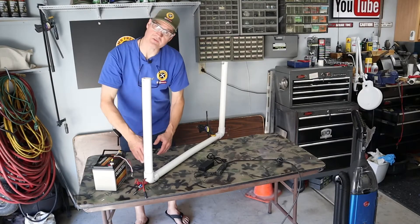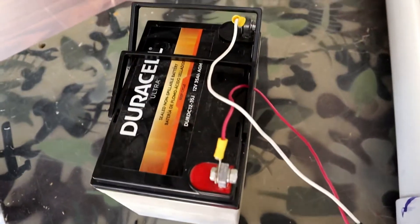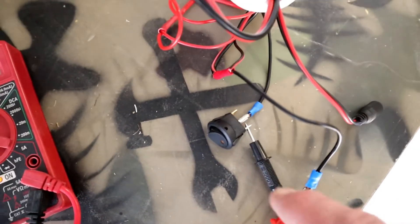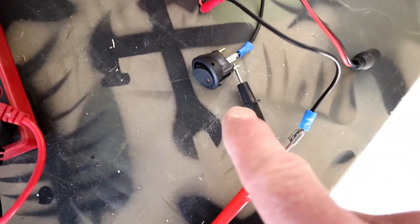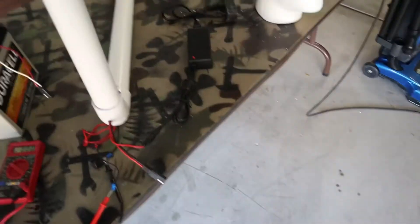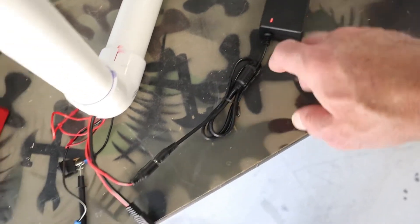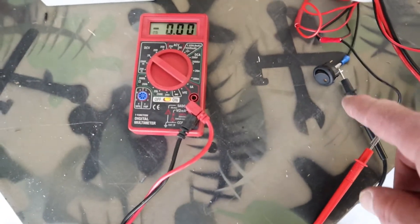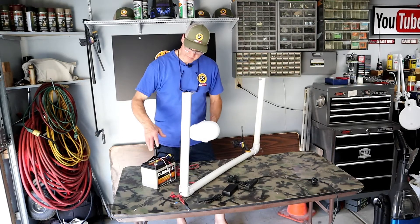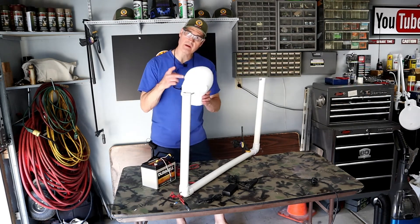Before I stuff the wires in and click the switch into place, I want to test both power sources. Our first test will be on the 12 volt battery — I've unplugged one side of the switch and we're showing zero, then I'll turn the switch on and we've got 12.93 volts. We're going to repeat the test for the power supply — plugged in with the open switch we're showing zero, then we turn the switch on and boom. Now that I've proven my circuit is good for both sources, let me clean these wires up and let's cut some styrofoam.